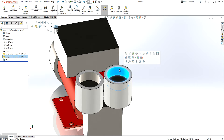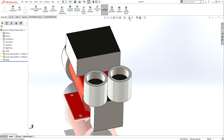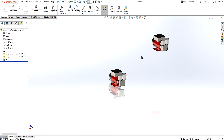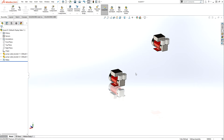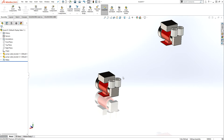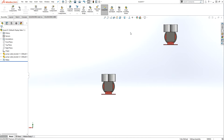This connection is one and a half inch, and on the pump there is mostly a female thread. For maintenance purposes, if this pump got damaged we have to replace it, so we must put here a flange or a union so we can just remove it to take out this pump and install a new one. We don't want to have to cut the pipes every time something happens with the pump — that is not a good idea.